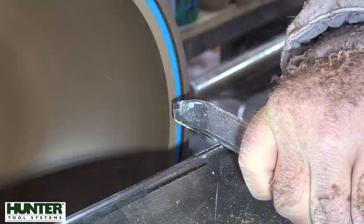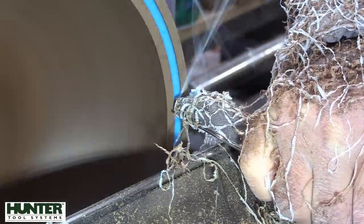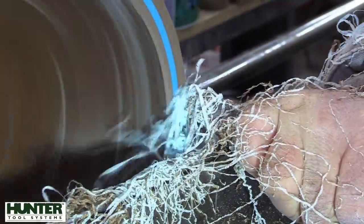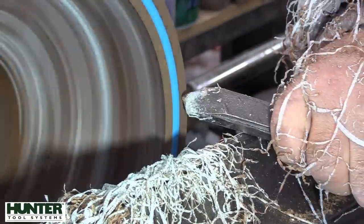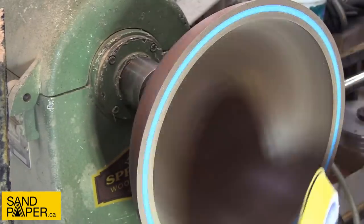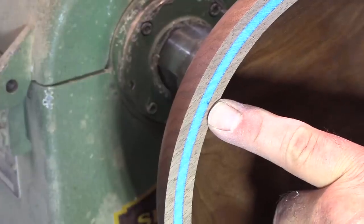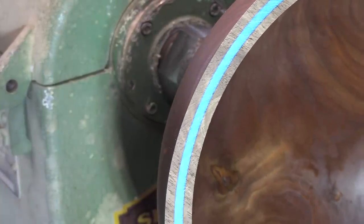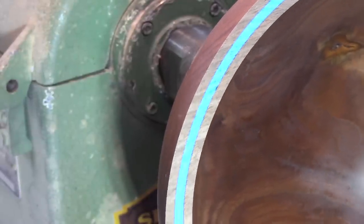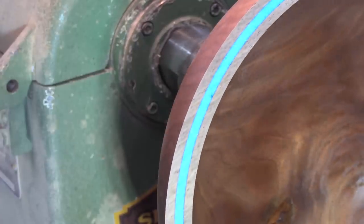For the turquoise, the only reason that I knew I was going to be able to tool this is because I've already done this on the channel. So that and the malachite. So I knew that it wasn't going to be an issue tooling that back. So you'll save some sandpaper there. And once it's sanded to 60 grit, it still needed some filling in some areas, which you'll see here in a minute. Very rare that you're going to be able to do an inlay in one shot, unless maybe you're using resin and it goes into the pressure pot, and you've got a really deep inlay that you're able to trim back.